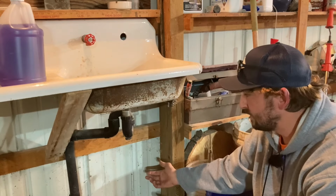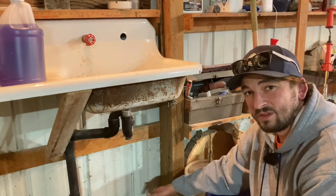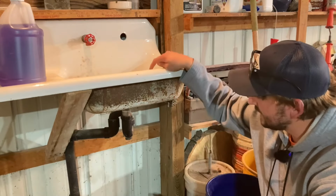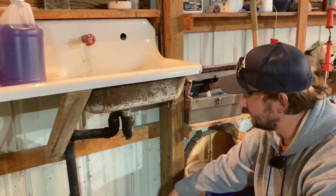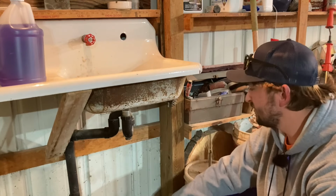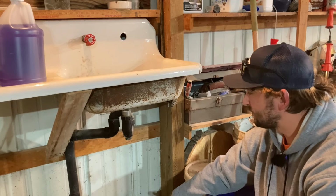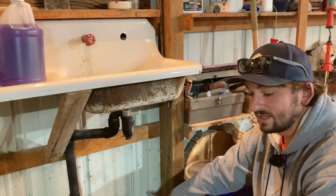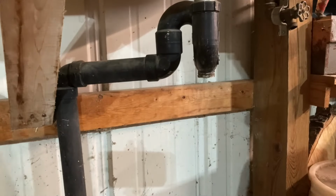If you don't have a drain plug or if you just don't want to deal with it, you can go to the store and pick up some RV antifreeze. You're going to want to put some RV antifreeze down the drain, enough to fill the P-trap. That's what I like to do. But today, I'm feeling a little giddy. I think I'm going to open the drain plug and see how that goes for me this year. I've never done it, but I don't really have RV antifreeze right now, so that's what we're going to do. Put a little drain underneath it.